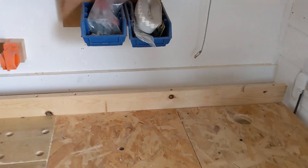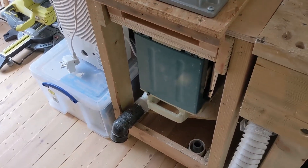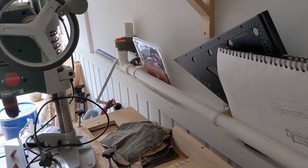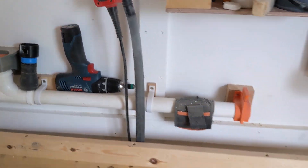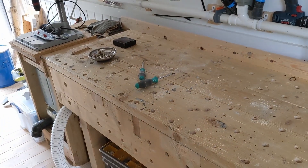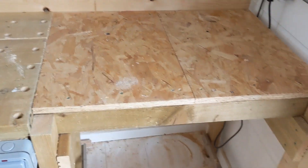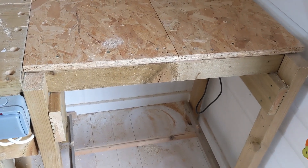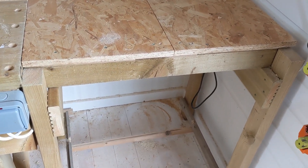The drill press port was good but it was too thin. When I started using this one for the thickness planer, it was too much for it - the 40 mil pipe just clogged up, kept clogging up around about here, which is actually the reason why the end pipe is off. I ended up using a large piece of trim to empty the pipe and that sealed the deal. The cyclone was taking up a lot of space, I put it in a stupid place so it was almost impossible to empty without dismantling most of the cupboard, and as I've just discovered the cyclone itself is cracked.